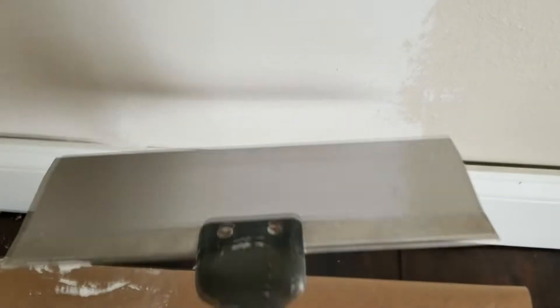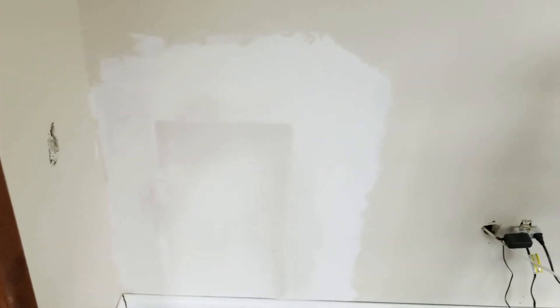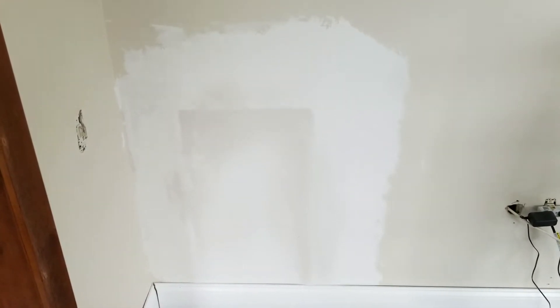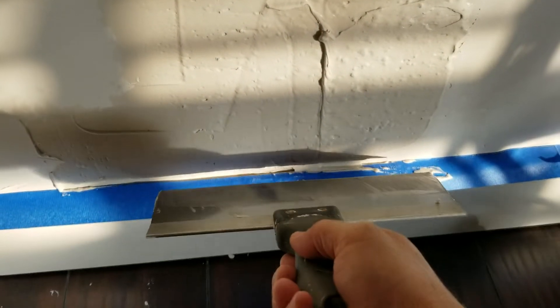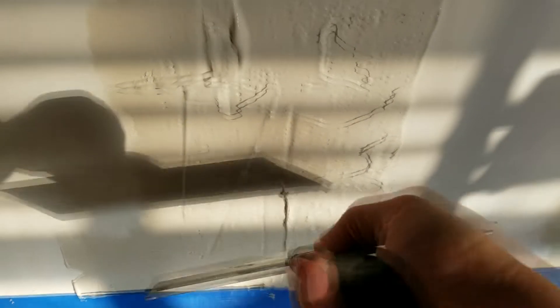And the same thing here on the right side of the hump — there is a little bit of curvature where you can almost see it down near the baseboard. When you put the taping knife there you can see a little bit of light shining through, and we want to fill those in too and feather it out even further. We'll probably come out almost two feet from where this bump is right here. Our goal is to smooth it all the way across so that anybody who walks in here will never know that there was a door there. So now we just glob some on here, start right where the ridge is on the right by the right edge of the blade, and drag it upward.